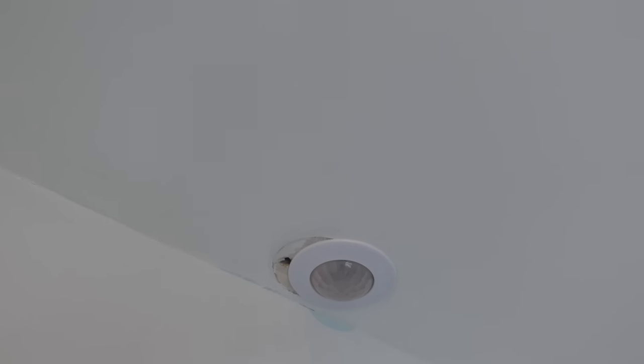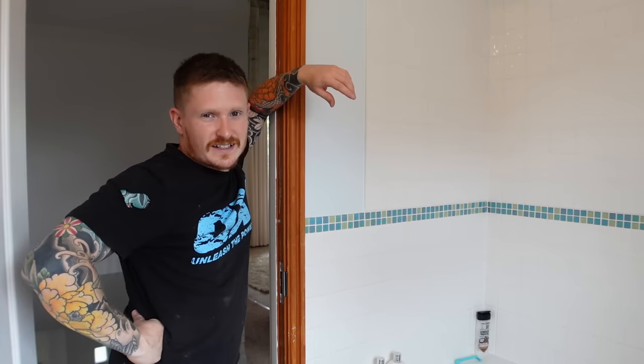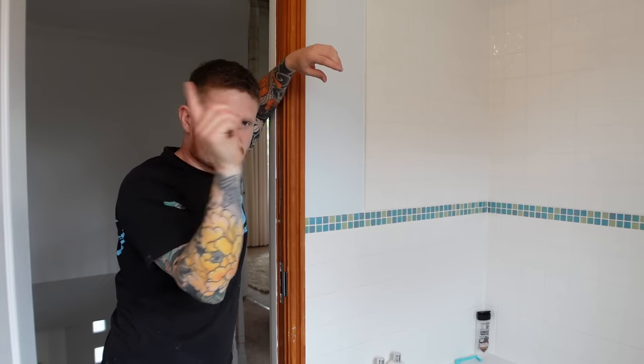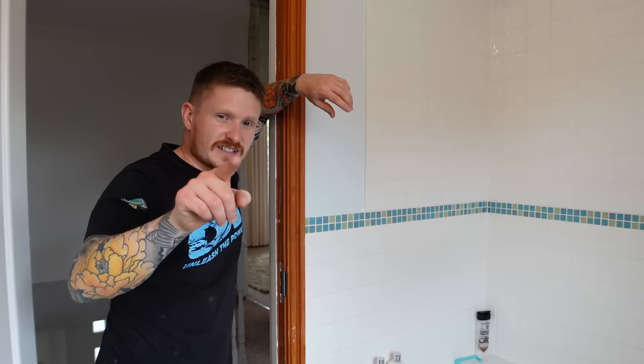As you can tell, we have light — job done! Once you've turned your consumer unit back on and have power to the circuit again, pull the PIR down and you'll normally be able to adjust two little screws on the side that allow you to set the time, brightness, and things like that — the box will tell you how. We have light to the main bulb in the bathroom and in this case a vanity spotlight, all now controlled by the PIR. All you need to do now is repair any ceiling damage with filler and paint, and tidy up any cables in the loft. If this video has helped you, give me a like and make sure you're subscribed — there's loads of content coming up. I'll put a link in the top of the screen to some of my other electrical guides. Thanks for watching and I'll see you guys in the next one.